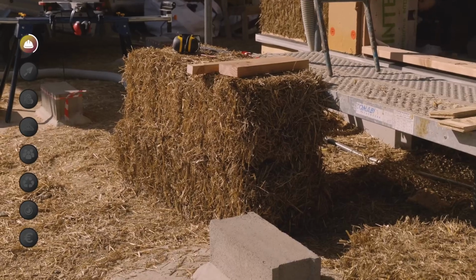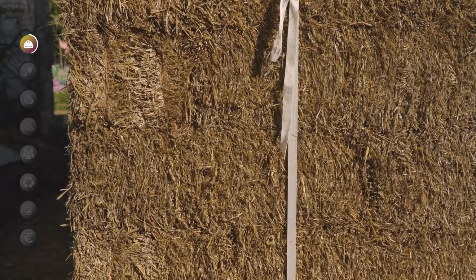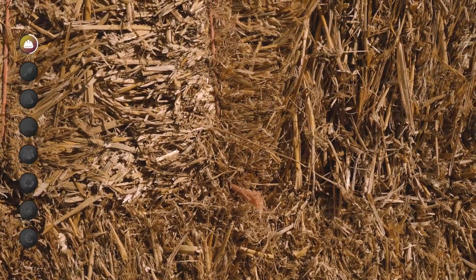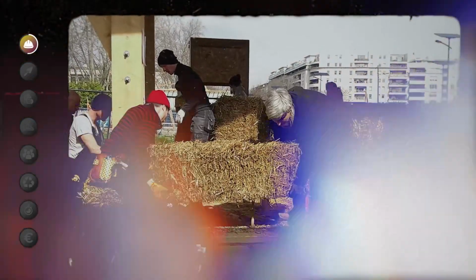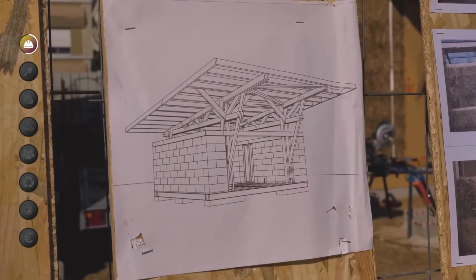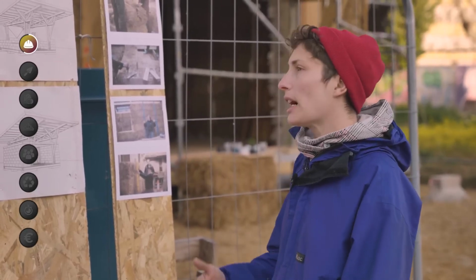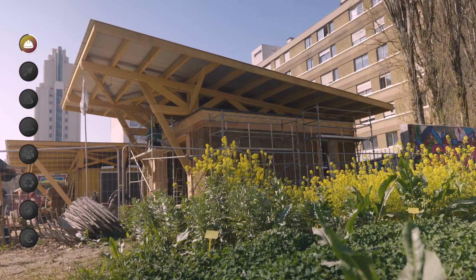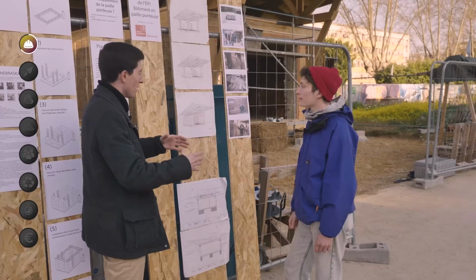And what is load-bearing straw? It's straw bricks actually. How does that work? Well, that's it. It's straw bricks. We stagger them like bricks, we mason them without binder. So there's no cement and no earth. Between the beds, they are stapled. So we go up like this, 7 rows, we put a peripheral beam and we compress afterwards with this peripheral beam to increase the mechanical resistance, the stiffness of the wall. And so we say load-bearing straw because it's going to carry the house, it's going to be load-bearing walls, and at the same time it's going to insulate.